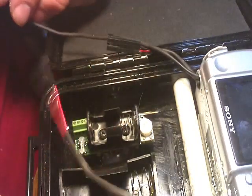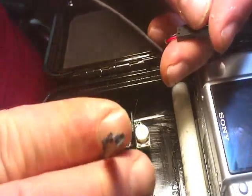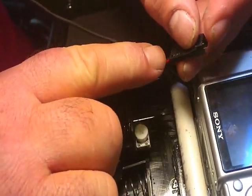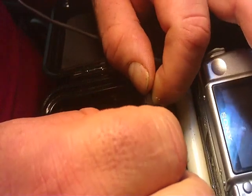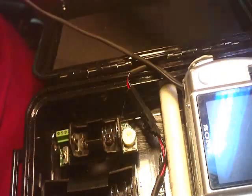I'm going to wire in the camera. I put a servo connector on my power leads, so for my external camera connection, I want positive to positive, negative to negative. I have a servo connector in here, so all I got to do is plug this thing together and my external is hooked up. I like a little extra wire in case I'm going to pull the camera away from there a little bit. We're good.